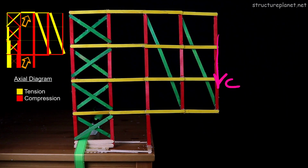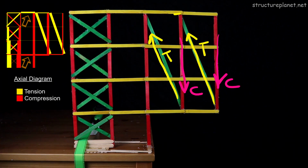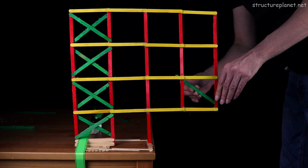As you can see, the back span beams on these 2 floors are forming the coupling action. The load path in this case is somewhat similar to the previous experiment, with the difference being that the topmost floor beam is now engaging in tension rather than the lower one.